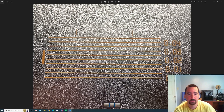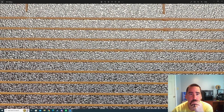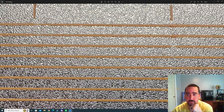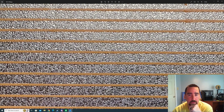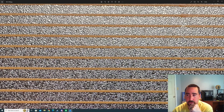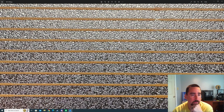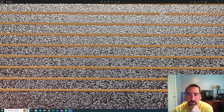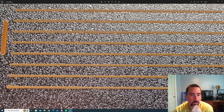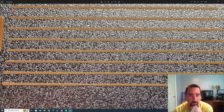The flow dynamics calibration has finished. Here's a close-up picture of the calibration — let's start from the top and work our way down. As you can see, we have some inconsistencies up top. We see a break here, it gets a little fat further down. We're starting to get a much more consistent line, though we're still seeing some issues. This line at 0.02 looks almost perfect.